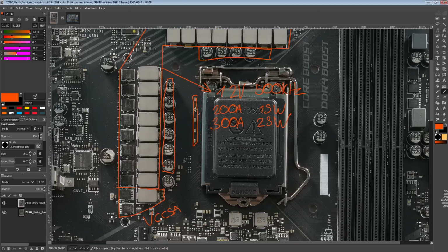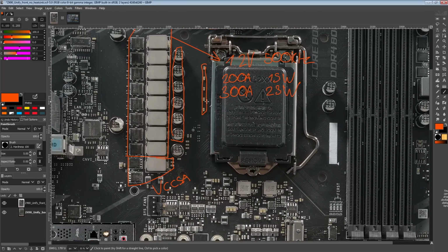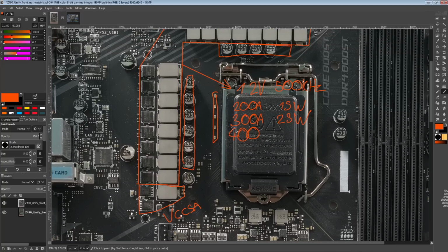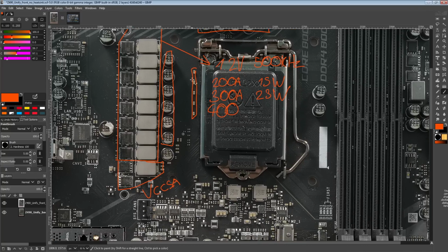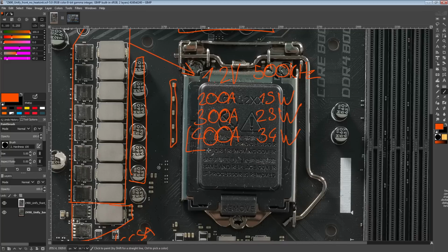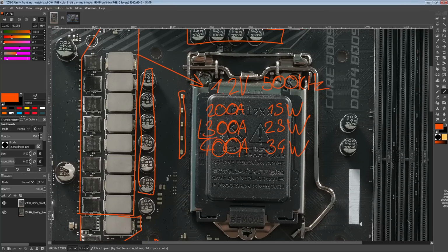So yeah, that's kind of the thing there. Anyway, 400 amps. So at 300 amps, depending on just how high the ambient air temperature is, you might actually need a heatsink. At 400 amps, the heatsink is no longer negotiable, but you're not going to hit 400 amps unless you're doing extreme overclocking, because 300 amps on a 10900K is doable. It's very, very demanding on your cooling system. You're going to need one hell of a cooling system to push 300 amps into a 10900K.